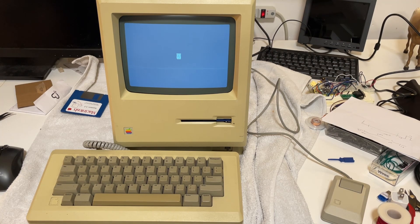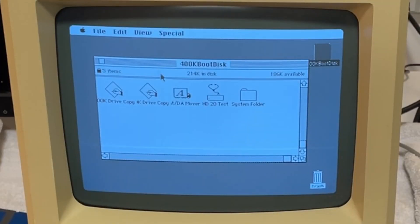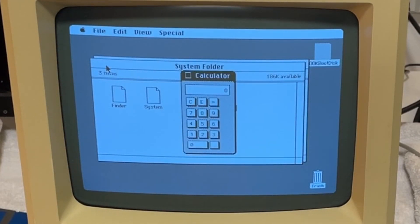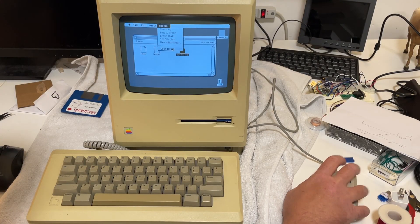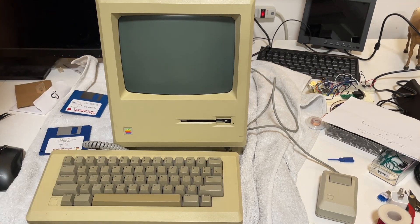Let's try it again with the other disk. Yes. Good. So that's about it — we replaced the 3D printed gear in the eject mechanism for the floppy drive, and we had a secondary repair of the analog board again, just had to refresh those solder joints once more, and hopefully this time it stays fixed. Anyway, hope you enjoyed watching. That's about it for today. See you next time.